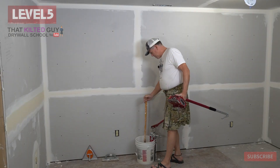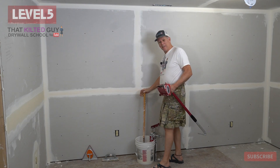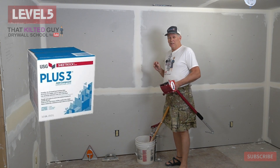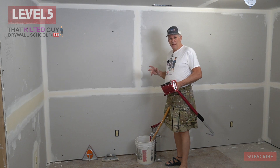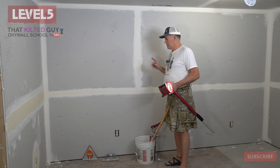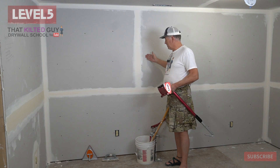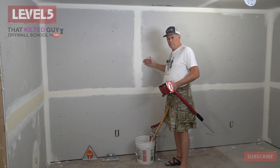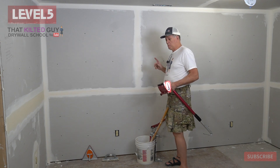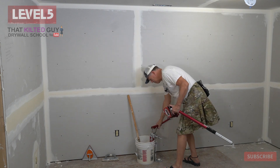I had a little bit of all-purpose in there, so I pumped it into my box and squeezed it out, and I'll mix it in. I'm using USG plus three — I don't really like using all-purpose regular weight for any coating. Sometimes it sticks too much; if you get a drip and scrape it off, it tears off the outer layer of paper. It sticks too good. With the plus three you can usually scrape it off safely — it sticks well but not quite that severe. So now we're ready to just pump the plus three in here.